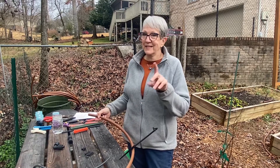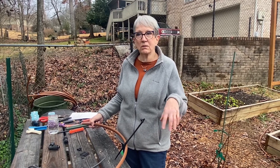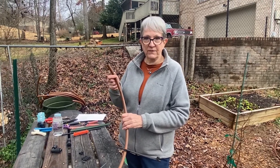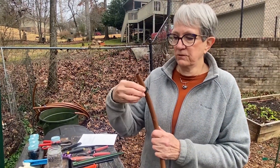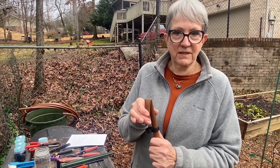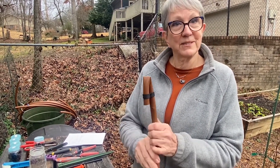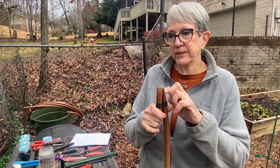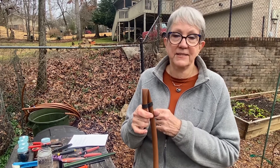Now that you've learned how to put the pieces together, you're ready to blow out your system — just turn on your clock to make sure it blows out any dirt or debris that got caught up in it. Then put your end caps on all the pipe ends. An easy way to do it is to take this little figure-eight end cap, place it on your pipe, run it down a little way so you have some room, bend it over, and feed that little piece up — that keeps it crimped. Alternatively, you can put a zip tie on tight and that'll do the same thing.